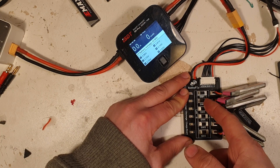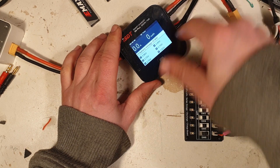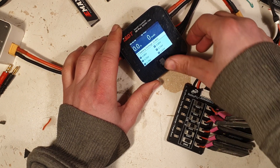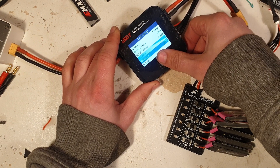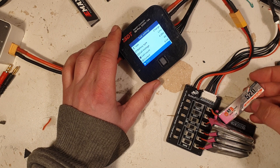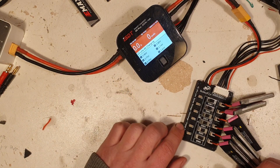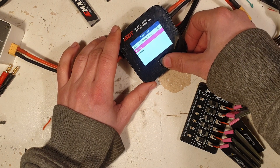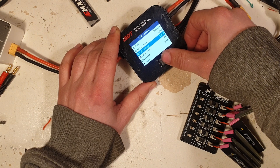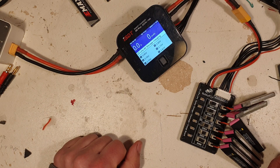Okay, so now we're going to flip the second switch to the left — 6 batteries: 1, 2, 3, 4, 5, 6 — flip to the right. Each cell — in fact, you can even use this as a battery checker, very nice. Charge, high voltage, 6S, 0.5 amps, because a single cell still has 520 milliampere. This now treats it as a huge battery pack — and start. Same thing with storage: high voltage LiPo should be stored at 3.85, 1.5 amps — and storage charge. Very nice.